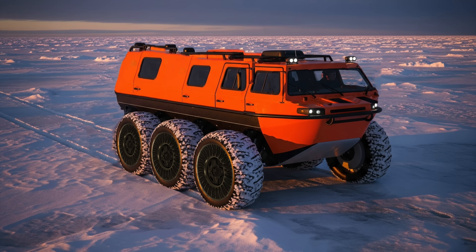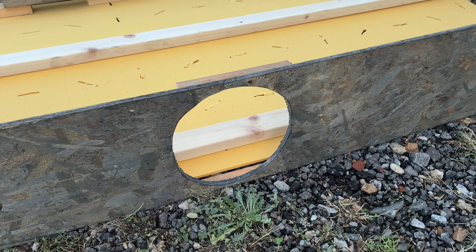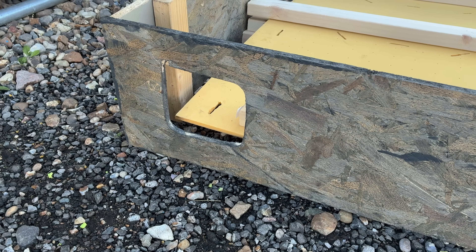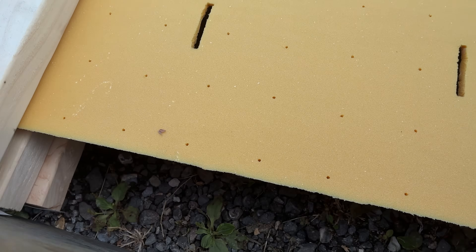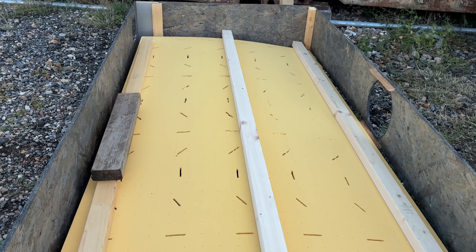By the way members, the September bonus episode is live and you should have the link and password. Top tier members likewise should have access to their private page and personalised September video, which prophesies this episode. I've completed the box — I wanted to minimise the volume to make best use of a single heater, and my thinking is thus: air comes in the middle on one side, and then has nowhere to go but the square holes in the opposite corners, encouraging near uniform flow. This sheet simply needs to be gently curved across the long axis, so a good first trial.